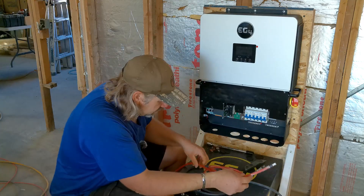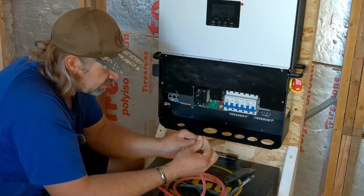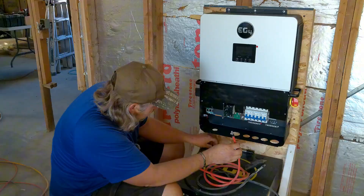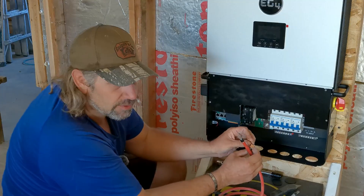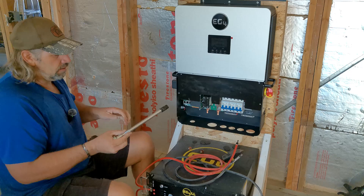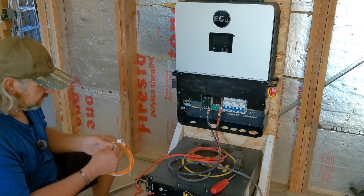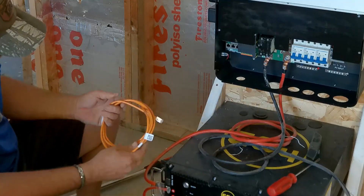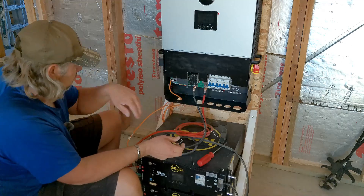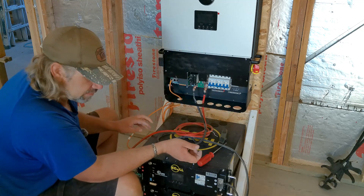We'll start with the battery cables. These are the cables that came with the 3000 and I don't have the proper connectors — this is how they came — so I'm using what I have on hand. Kind of out in the middle of nowhere, so you make do with what you have. You want to torque those down — all your torque specs are in your user manual. There's a battery communication cable, so this is battery one. We're just going to use the cable off the 3000, but they're actually different connections. So that hooks up our batteries.